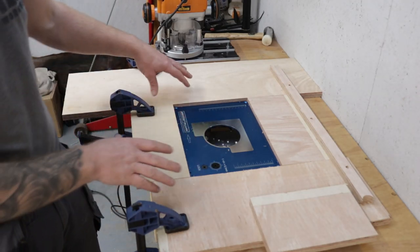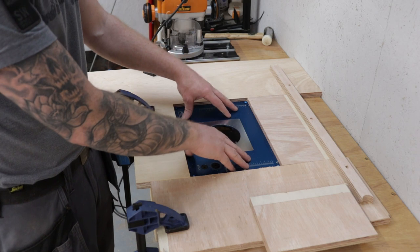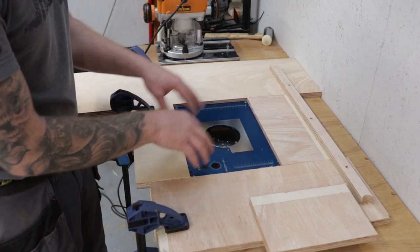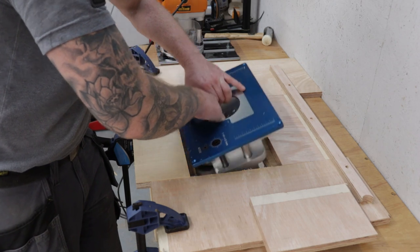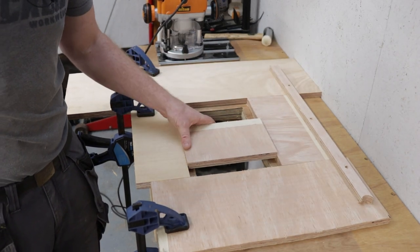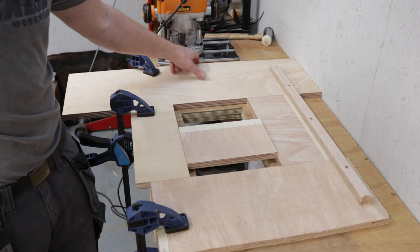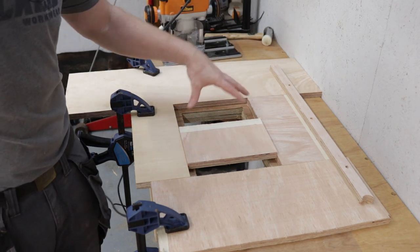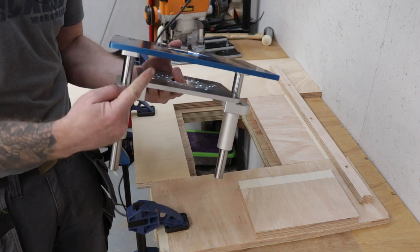I have the hole cut out. I took some pieces of plywood, ran them over the planer to put perfectly straight edges on them, and cut them all to size. With the router lift sitting into the table, I made my template by making sure everything is exactly up to the edge of the router lift and that it's exactly where I want it. I built the frame using the router lift itself, then screwed everything together. I've also made a little insert piece to sit in the hole to support the router while routing, since the hole is pretty big and the router could tilt without support. Now I'm going to route this out to the depth of the plate.